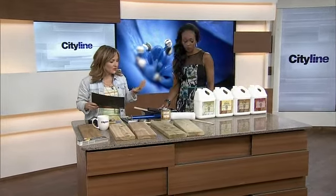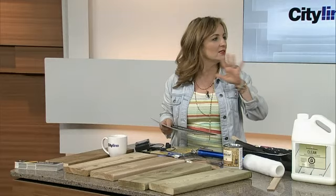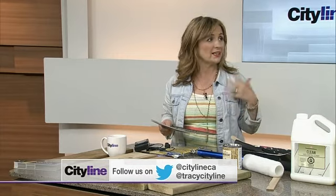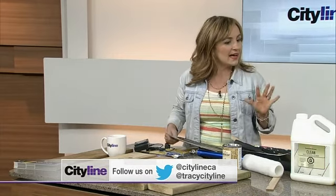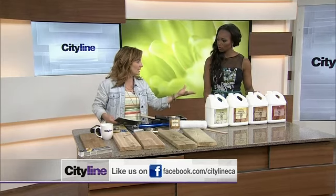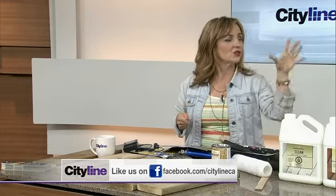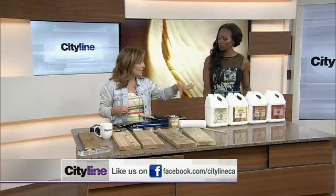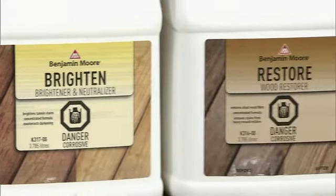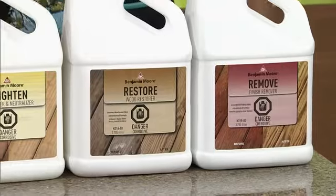I'm going to show you a couple of things. You start off thinking, okay, what is my wood like? Is it an old deck I've inherited? I want to get rid of the finish that's on there because I really don't like it. It's peeling, whatever. In that case, there's a lot of different products that you can use depending on the condition of your deck, if you don't want to just get out there and sand the heck out of it. Benjamin Moore has this full line of cleaning, restoring, removing. You've got almost a full-on nail polish remover type of product that'll take the product off.